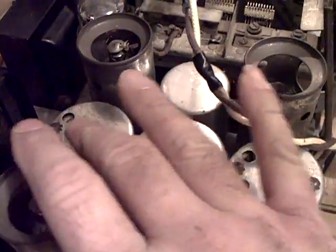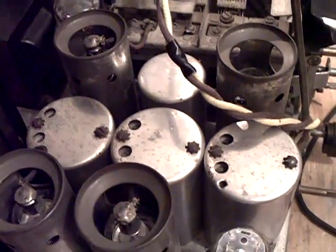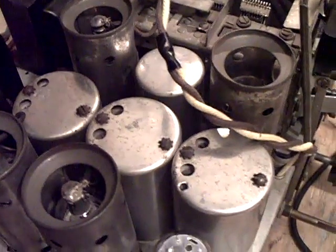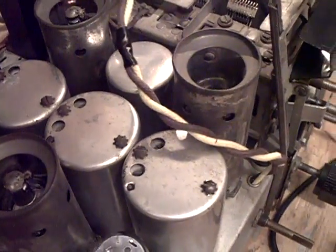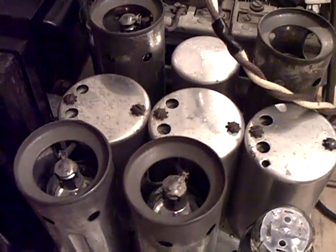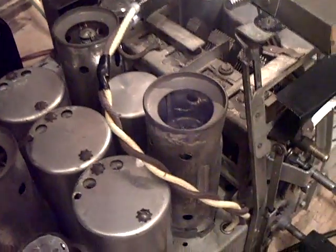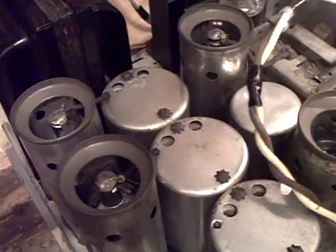I guess what I've got to do next is test the alignment on the IF stages — there are three of them. I've got to dig up some documentation on the Code 121 chassis. I found something on how to do alignment on a Code 125 chassis, but that's just the 4-band one and this is the 5-band one. So I've got to try to dig up something on the Code 121 chassis and do the alignment next. Maybe the shadow graph will work better once it's aligned, but it's getting something out of it — I'm really happy about that and it doesn't sound too bad. It's a lot of volume.